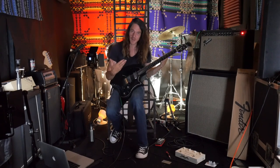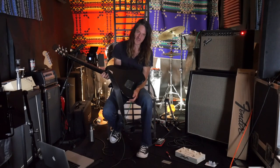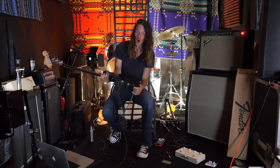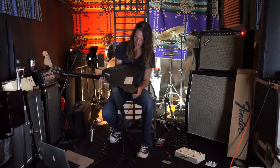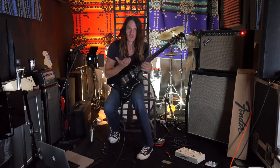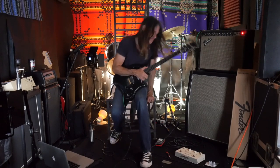I should be writing songs instead of spending so much time on pickup height. Anyway, that's what I found out about the electronics. Lucky me, the prototype did not have that battery foam pad — the piece of foam that ends up flaking, disintegrating, becoming carbonized, and melding with the circuit board, causing it to ground out and screwing up the traces. Also, another common failure is forgetting to remove the batteries when you put the guitar away — they go bad, corrode, and ruin the electronics. Just like toys that get ruined when you leave batteries in them.